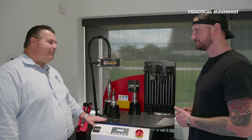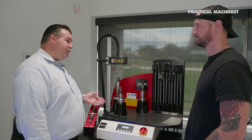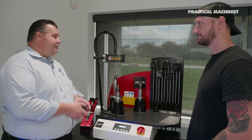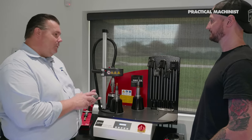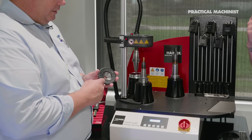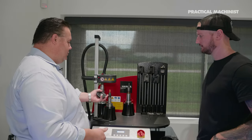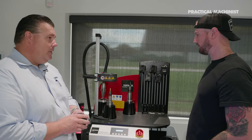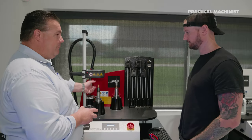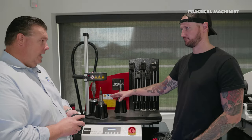This is actually our most popular heat shrink machine — the Power Clamp Special Edition. It has the capability to shrink tools from 1/8 inch (3mm) up to 1-1/4 inch (32mm), using our V2008 coil with five stop discs from 1/8 inch to 1-1/4 inch. A stop disc is a ferrite disc you put in the top of the coil which channels the energy to induce heat into the tool. You need the right stop disc to put the energy wave in the correct position — this doesn't heat itself, it just heats the actual tool.